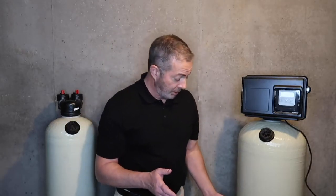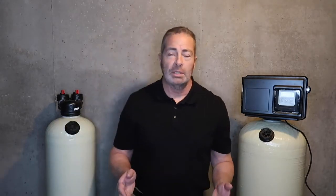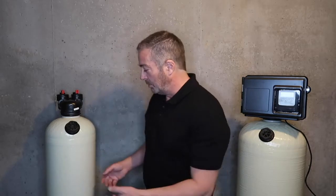If you have excessive water usage and an extremely low pH, it could take two bags. In my years doing services and installations here in Maryland and southern Pennsylvania, I could go to a house in 12 months with seven people living there and the unit is half empty — it could take two to two-and-a-half bags of calcite. The same applies to the 1.5 cubic foot unit.